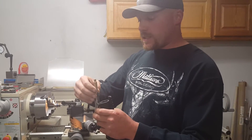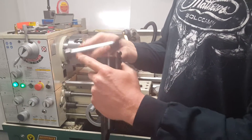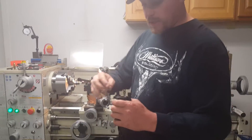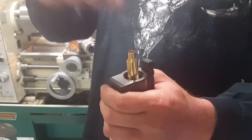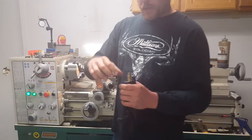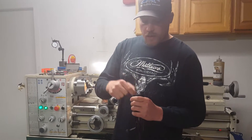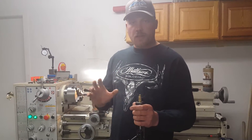When the bullet is in line and concentric with the bore, everything has to be right from the back. The face of the action and the bolt has also been cut, as well as the back of the lugs. The front of the lugs I did not touch — you can do that for cosmetics but it doesn't do much. The bolt has been lapped before any chamber work. When everything mates up square — the face of the action square through the thread — you don't have any stress points down either side of your action. The face is square, the lugs are square, everything is sitting square, so that bullet will enter the bore concentrically.